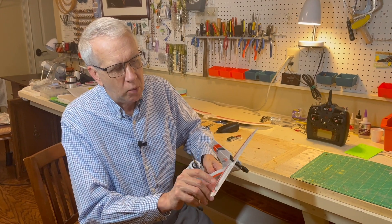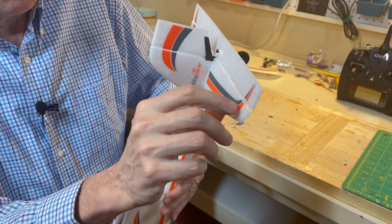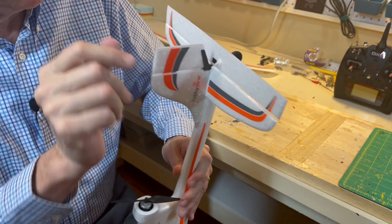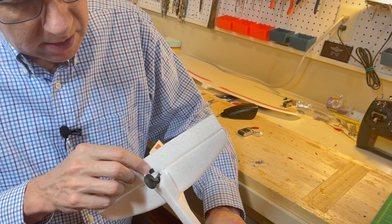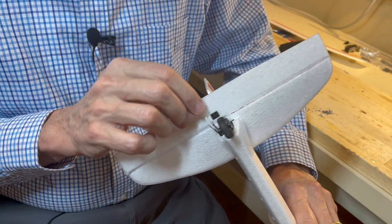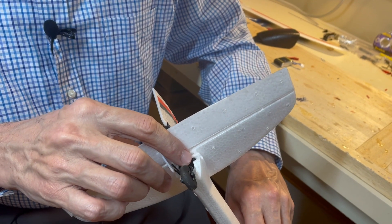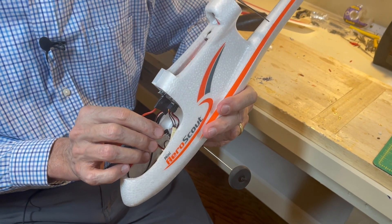The back was a little bit of work. With the elevator, I noticed when I took out the radios and disconnected it, it was fairly stiff back and forth. What had happened was the manufacturing process - they didn't put in any hinges, they just compressed the foam along here to make a break for the hinge. I cut that completely out and put on clear plastic tape on both sides to have a very free hinge. The existing control horn toward the back was short and not in the right place - I felt a little bit of binding. I trimmed that off, put in a regular control horn and connected it, cutting out a little bit of a slot to make sure there was no binding. And I did have the luxury of doing that with the rudder because the horn is right there. Things worked out okay, and the key to the whole thing was just to get more control throw with the regular servos.